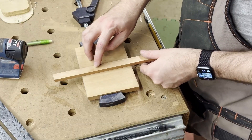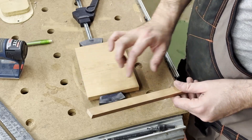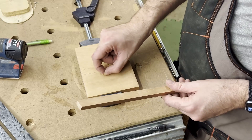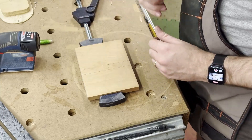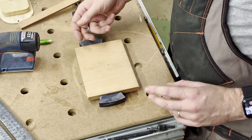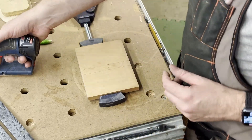My strip here is going to sit in the middle of this board. I want to relieve some of the material on the sides so that it's riding on the edges and is a little more stable — if there's a high spot in the middle it might wobble. So I'm just going to run the planer over it real quick, take out that material on either side of the strip, and that way it's supported on the edges. That's how it shows in the manual. I don't know that it matters super much if this is a nice flat board, but we're going to do it anyway.